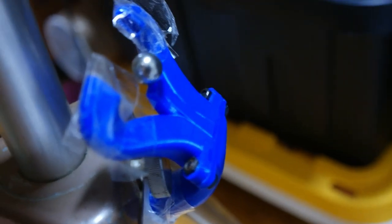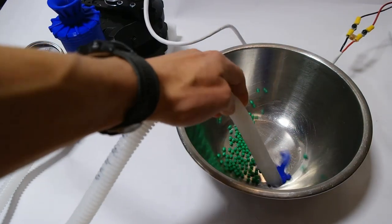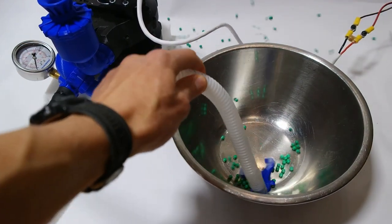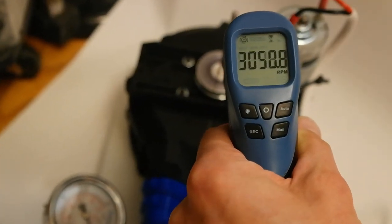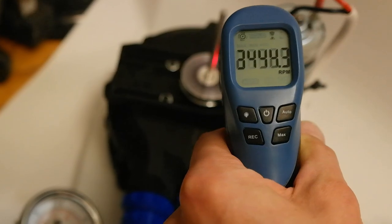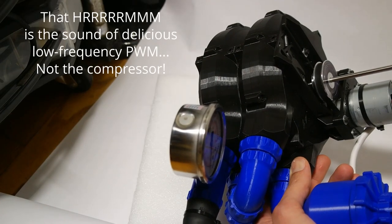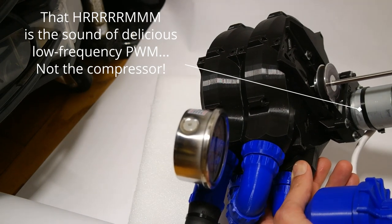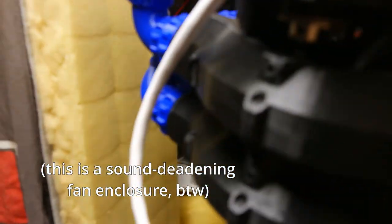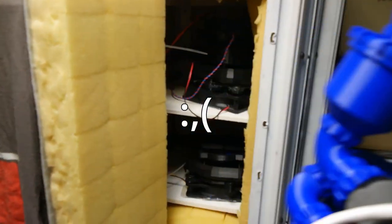So does it suck? I think not. Except it's still not perfect. The biggest problem is motor control — driving this big of a motor quietly on PWM is tricky. So even when the compressor is quiet, the motor isn't quiet. Also, it's not very compact. It's actually too big to fit in the place where I would put it to use it on my printer, so that's a problem.